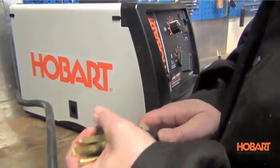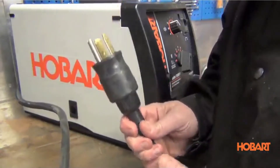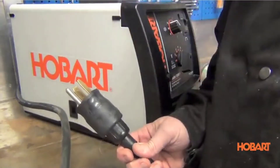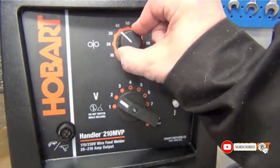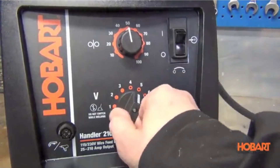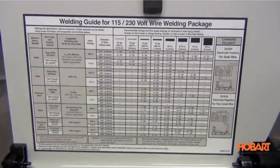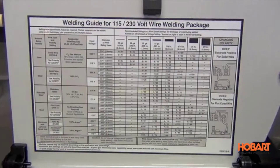Positive side of this product: dual voltage — depending on the task at hand, you can choose either 115V or 230V. Infinite wire feed speed control, which ranges from 40 to 680 IPM, giving you maximum control over the amount of weld penetration. 7 voltage selections for 230V and 4 settings for 115V, giving you ultimate control over your weld for creating a high-quality arc and at the same time having less cleanup and spatter. Spool gun ready — you can buy an optional Spoolrunner and plug it in directly to the machine, which helps alleviate feeding issues when working with soft aluminum wires. The quick-select feature allows quick change of wire type and size without the use of additional tools. Safety features include built-in contactor, thermal overload, and motor protection.